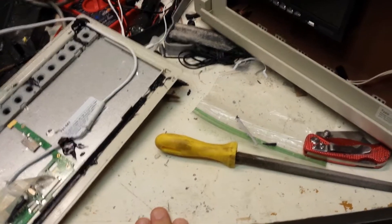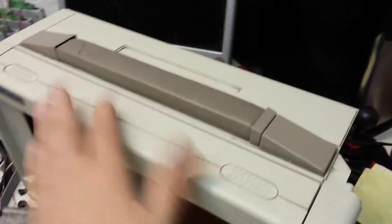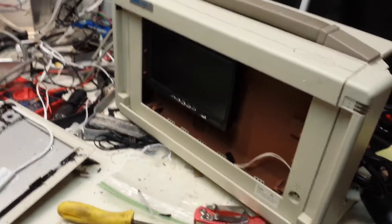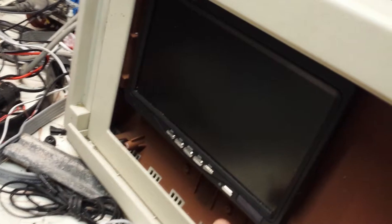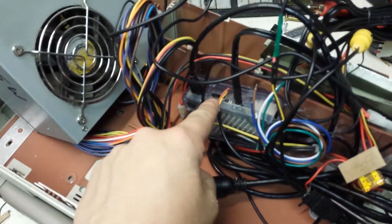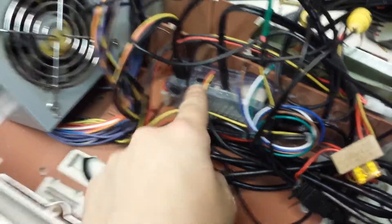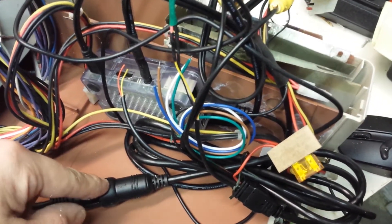I could fake it, but I really, really wanted to make a luggable computer. So I bought this on Craigslist — it won't boot up, the screen didn't work, and the keyboard was broken. I took all the guts out. I've installed a 7-inch LCD screen, but I actually want there to be room for a cassette drive right here. I've rigged up this old computer power supply to deliver 5 volts to a Raspberry Pi right here, and then deliver 12 volts to the screen right here.